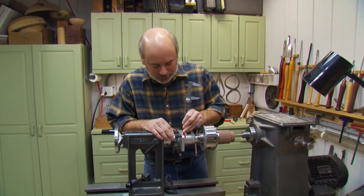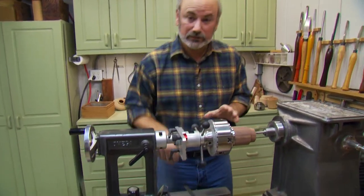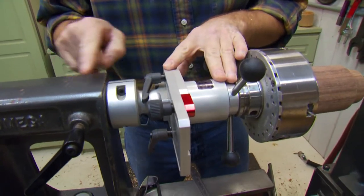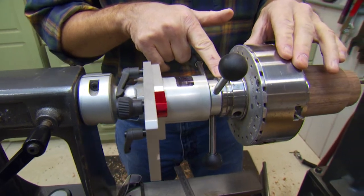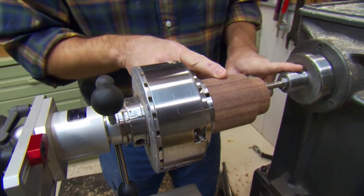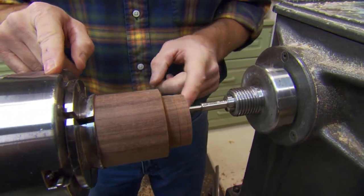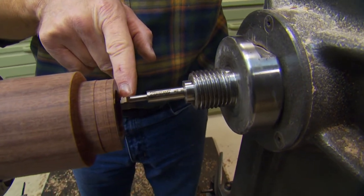That looks good. Well, I'm prepping our thread jig. Cool little system here. It rides on your tailstock and on the ram in your tailstock. Then it has threads on here to hold your chuck. Pretty cool on that part. And then when you work your way up to the headstock, you have a Morse taper collet that holds a cutting tip. It's a little sharp thing, it's hard to see, but that is what does all the work.